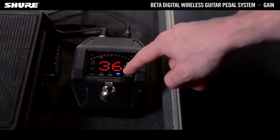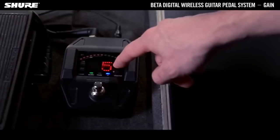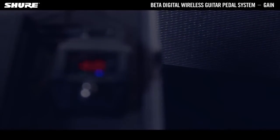The intensity of the green audio LED corresponds to the audio level. Rapid flashing indicates audio clipping. Reduce the gain to remove the overload. Gain settings remain saved even if you link a second transmitter.